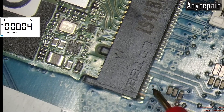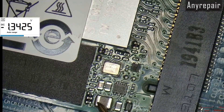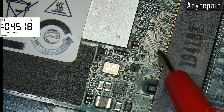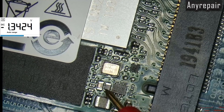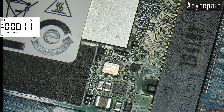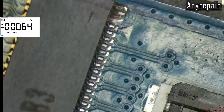I'm pretty sure that voltages are on the other side of the NVMe slot. Let's check on the NVMe drive. We can see we have 1.3 volts here, 1.3 volts here, and 1.3 volts also here. So the voltages are present on this drive. But what are we missing? Because if voltages are present, the data lines or something is not right.